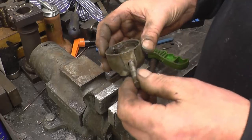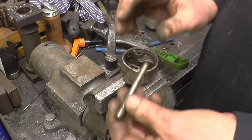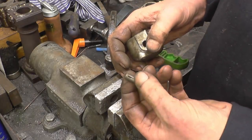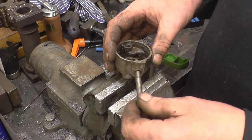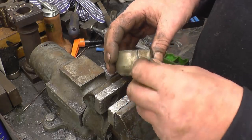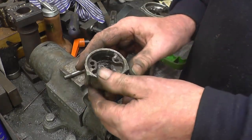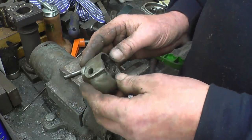I've managed to get the cross shaft out — you can see how much wear is on there. The shaft's actually worn as well, but I think you can get a new one of these shafts. So I'll carry on — I'll drill that out and bush it and ream it to that size there. I'll have to set this up so I can drill that and keep it nice and straight. I've got an idea how I'm going to do it. That's the next job — drill that.